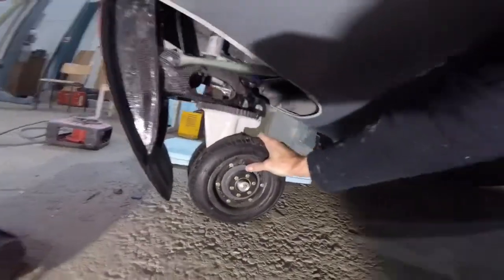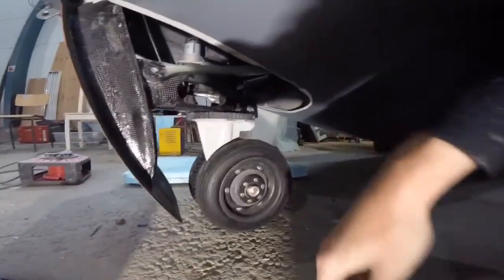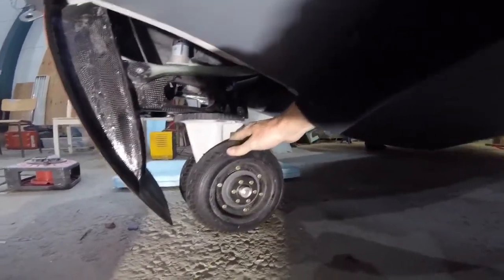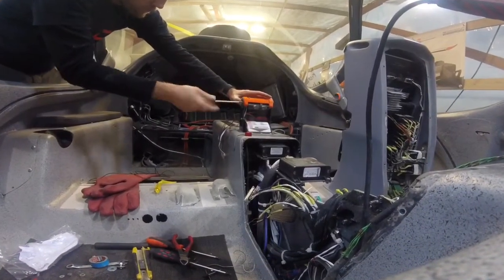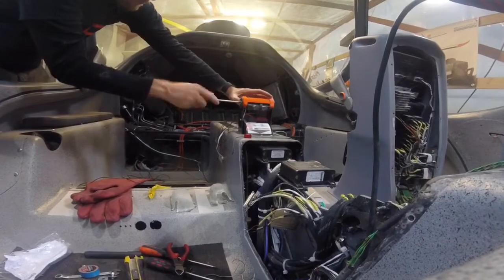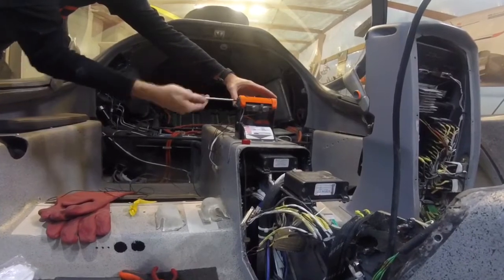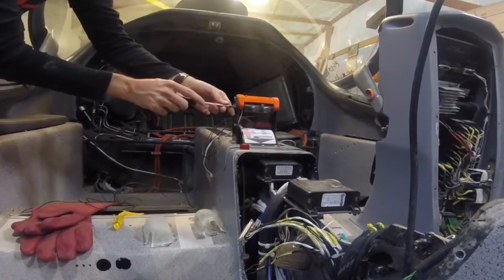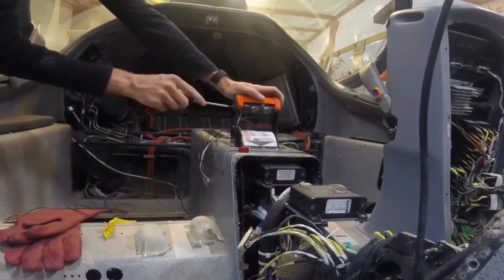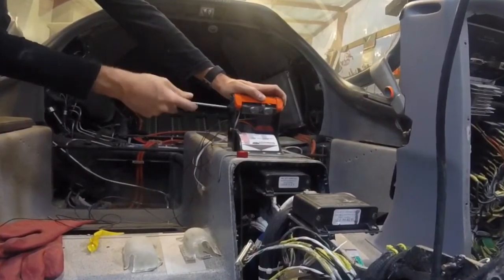With the weight back on the gear, we could start preparing the electronics to control it for a test. We put back the throttle handle — or power lever — with this new setup of buttons. It's not really a good ergonomic solution, but it is a fully blown prototype that alleviates all those problems we envisioned. The fly-by-wire and the drive-by-wire are now completely disconnected from each other, making it a little more secure for the first testing of the aircraft with no conflict between the two.